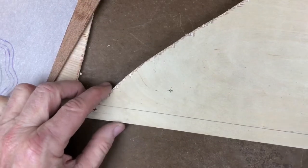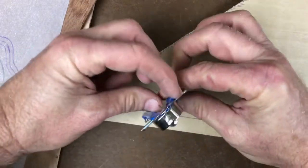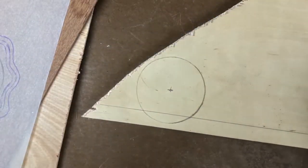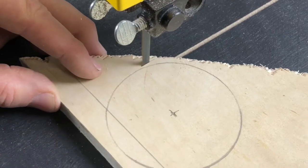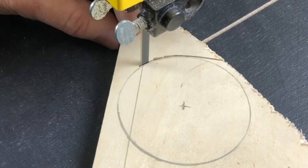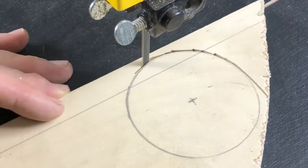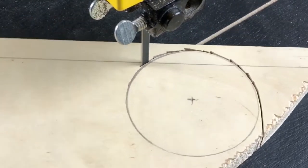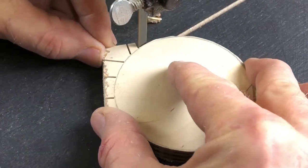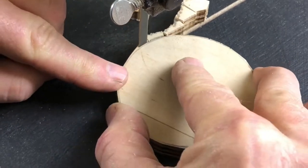Starting with a piece of scrap, let's lay out a three-inch circle on the old wood — that's going to be the base. The radius of the circle I'm cutting is too small for this quarter-inch blade, so I'm just using kind of a hack attack, carving my way around it. Alternatively, you can just cut down into the line and the relief falls away — you don't have to bother with the old peck method.